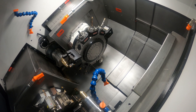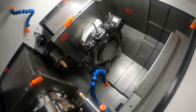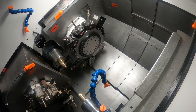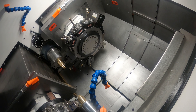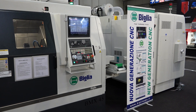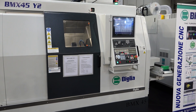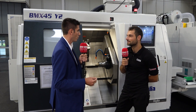The milling capability is so important nowadays when people have to make more complex components and stay competitive. They can't mill these components on a different style of machine that might require smaller depths of cut or slower feed rates. With the Belia and its sheer rigidity, it allows us to do better where Swiss-type machines are struggling — we are entering that market. The important thing is the built-in spindle, because this machine doesn't have belts, so the built-in spindle increases the capability in both turning and milling.